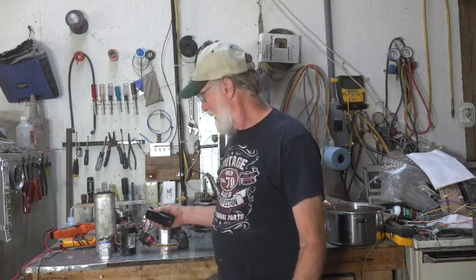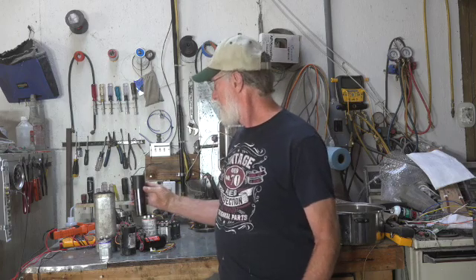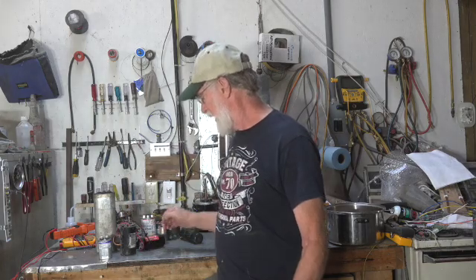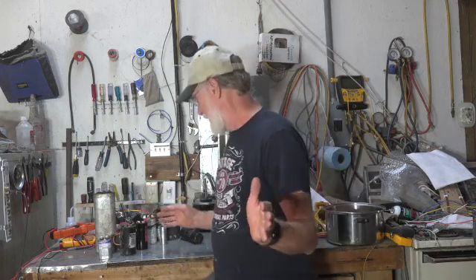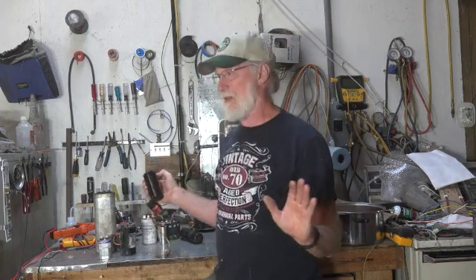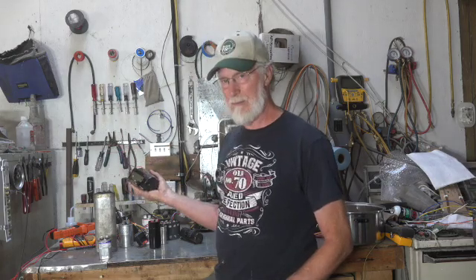Like I said, I'm not real thrilled with these. They're okay — they do probably a better job than this. But this is for a failing compressor. This should only be for a failing compressor, not for making it start better. I have one guy tell me that it lowered his electric bill by putting one of these on. I'll just suffice it to say that starting amps does not trigger a demand meter on a demand meter system. I would rather want something like this — a factory one. The factory one is designed to work with that system, with that compressor.